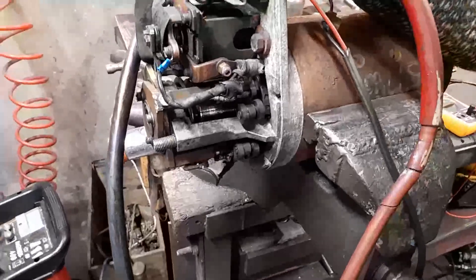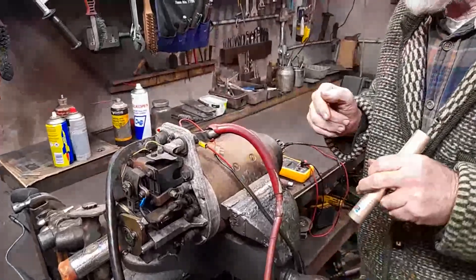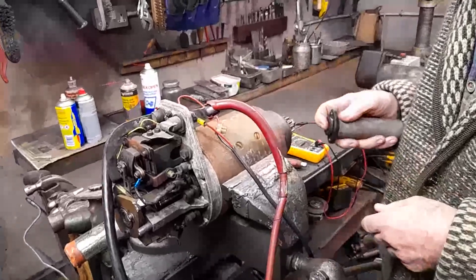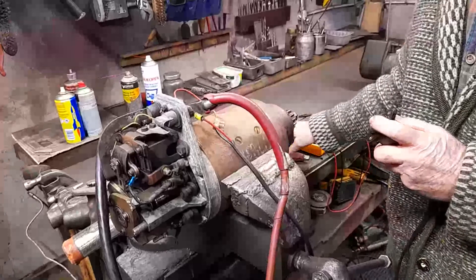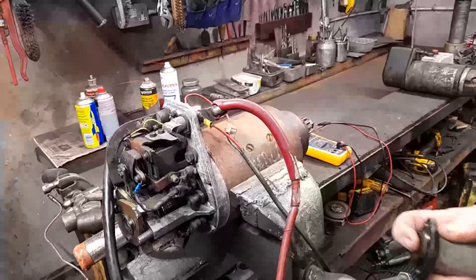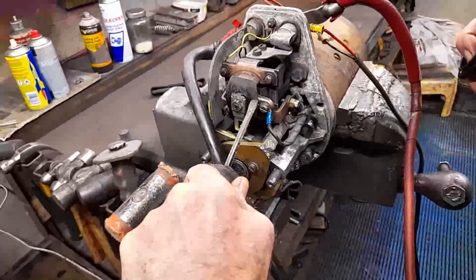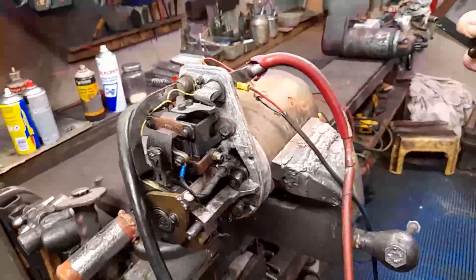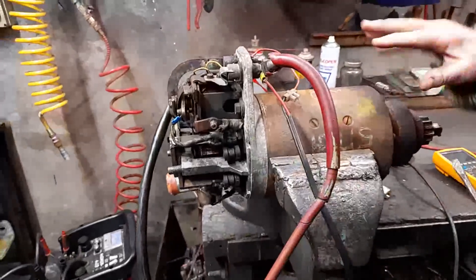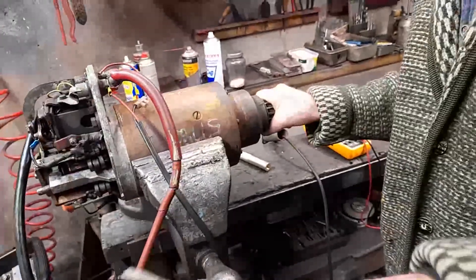Possibly this coil here has just got tired with age, or this needs adjusting here. But if you're out at sea and your starter's displaying this fault, how can you get your engine started? Well, it's another one of my get-me-home tricks. If I press the button and simply get a heavy screwdriver and push on there like that — the engine will start. Because I've completed this circuit here, the full current is coming in to the main windings and that's causing the pinion to spin energetically.